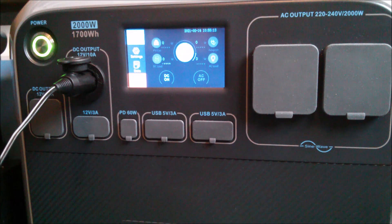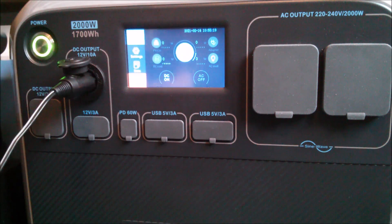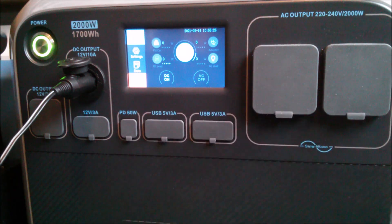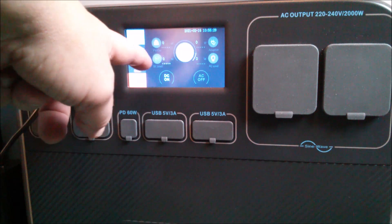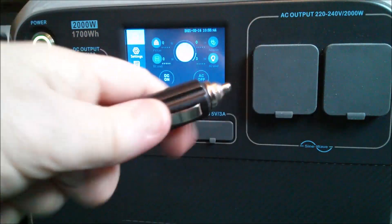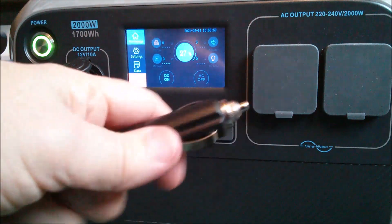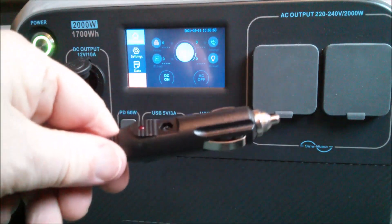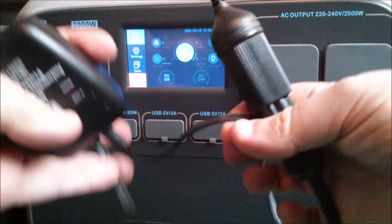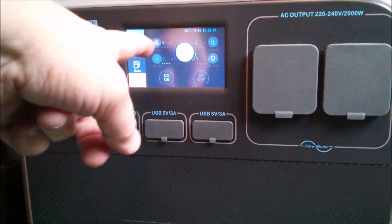So now what seems to be happening is the ever so slightly improved resistance lowering in this plug means that the whole original concept of adding this bit of resistance to this heater fan to try and keep it below the cutoff threshold of this power bank isn't working anymore. Oh joy! This plug though doesn't feel too hot - ever so slightly warm on the tip - but no, that feels all right. I think that may have done the trick but it's overridden the whole principle of this experiment, which was to add this wire of resistance to the fan circuit to not trip the overload.